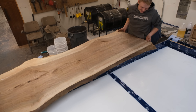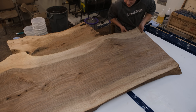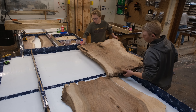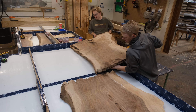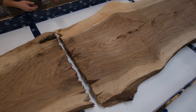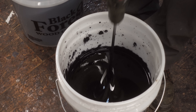There are other YouTubers doing this style of table who swear by sealing the edges because it reduces air bubbles — and that is absolutely true. But the reason they have to seal their edges is because they're not controlling the environment they're pouring in and cooling it like they should be, and they're not using a high-quality resin that's designed to release bubbles without sealed edges. If you seal your edges, you just get a plastic-on-plastic bond. Even if you sand it, it is nowhere near as strong as pouring your deep resin directly on that exposed edge, because without sealing you essentially form thousands of little fingers that soak directly into the edge of that piece of wood.